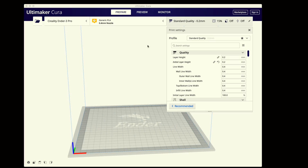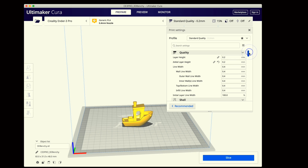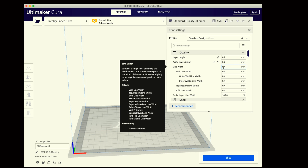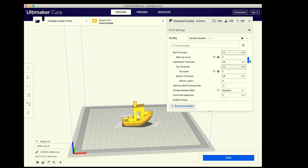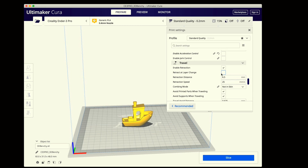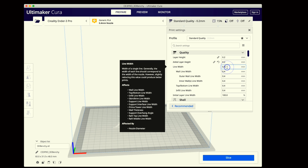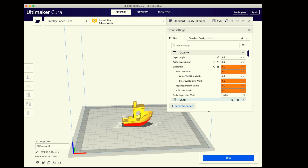Here we are at the computer with Cura open. Let's drag our benchy in. The normal settings we use have layer height at 0.2 and the nozzle size set to 0.4. Everything else is the basic parameters I always use. Since we're going to the 0.2 nozzle, we change the line width here — this is the nozzle size — to 0.2. You can see it all turns orange; I'm not sure exactly why, but I guess it thinks it's a bit out of spec.